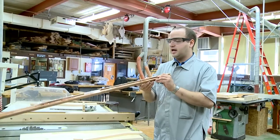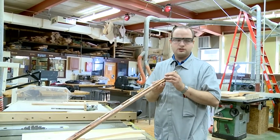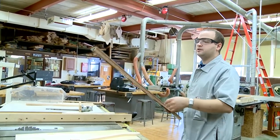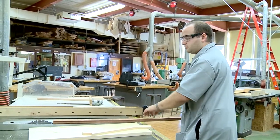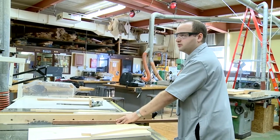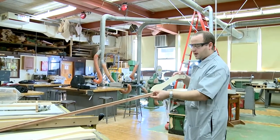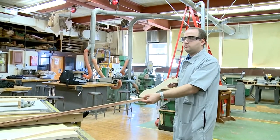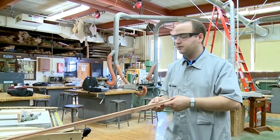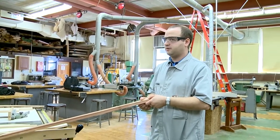Okay. So I had two cuts. I had to cut one way, and then at 90 degrees, I had to cut another way. So we have a strip of molding. On my second cut, this was a bigger board at the time, by the way, I had it like this, so my molding was between the fence and the blade, just like this, okay? At the time, the push stick wasn't low enough to grab onto the molding as well. So that was a problem, and my other problem was I forgot to remind my catch person that not only did they have to grab the big board, but they also had to grab the little piece of molding that was there, okay?